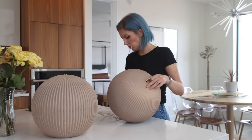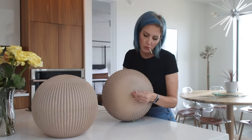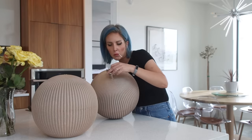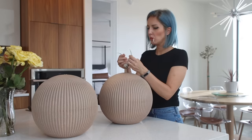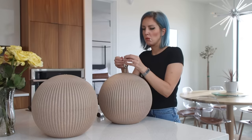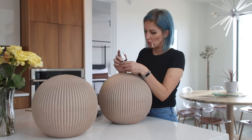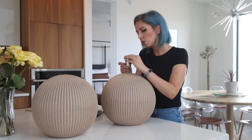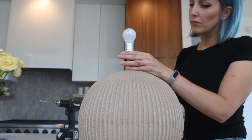With all my components prepped, I began adding my lamp hardware to the lawn ornament bodies. When creating your own DIY lamp, you can purchase all your lamp hardware components separately, but I highly recommend purchasing an off-the-shelf lamp hardware kit — they're fairly inexpensive and they include everything you need, from wiring to brass hardware to the light bulb socket and lamp harp. I purchased my lamp kits on Amazon and included a link in the description. When it came time to wire up the socket, I used an underwriter's knot, which loops the wires into a pretzel shape to protect the wire connections in case the cord ever gets pulled. The connection between the wires and the socket is made using conductive brass screws.